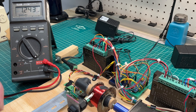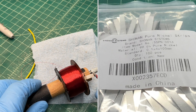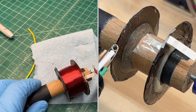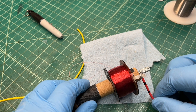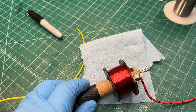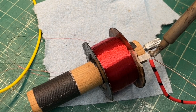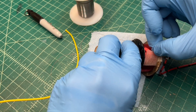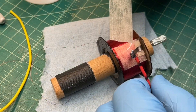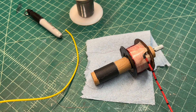Let me get started on the lead dress, and then we can get the humbucking coil back in place. I used a very thin nickel strip for my innermost start winding and brought it up the side. I'm going to crimp this down and solder my new lead dress at this location, then fold it over after putting some transformer tape down over this area. I'll let that cool and flip it over to do the back side, then add one more small piece over the top and wrap additional layers.